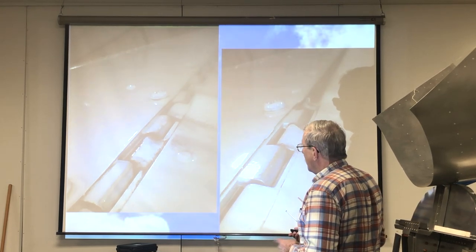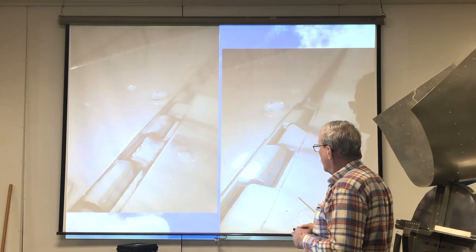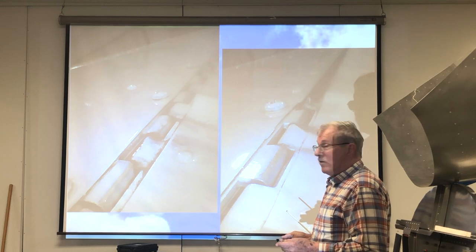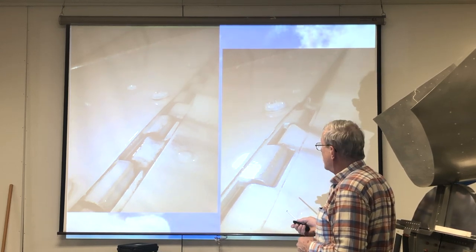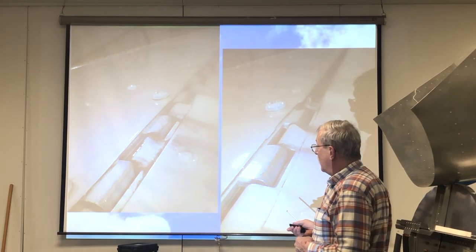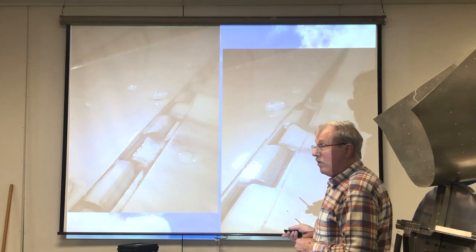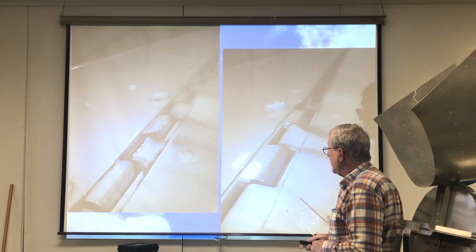And the light oil that they call for is a light machine oil. It's like 3-in-1 oil. We have found that using that, it tends to wash out of the gaps if you get in the rain or something like that. However, 40 or 50-weight engine oil will really hang in there and keep those things moving really easy.